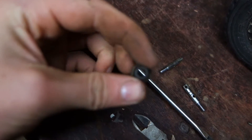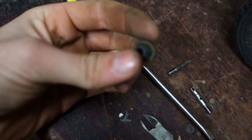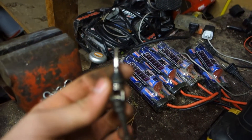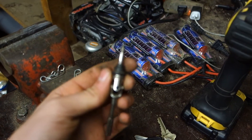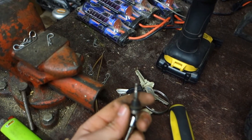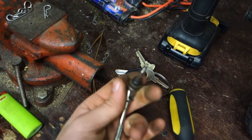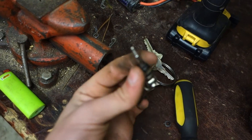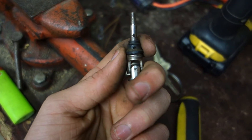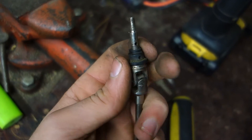After drilling, make a really clean hole, then test fit it on the shaft to see if it needs to be drilled out one size more or just rounded up on the drill bit. I just drilled the plastic washer — the spacer. You want this to be as tight on the shaft as you possibly can. If it's really hard to get on and off, that's fine, especially if you're going to have an upgraded axle.